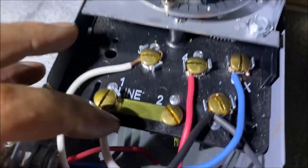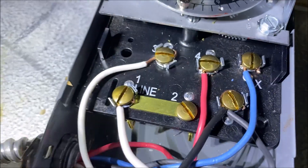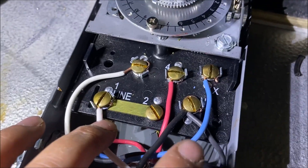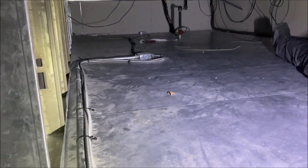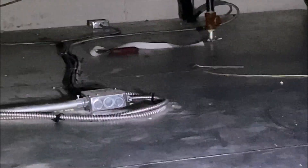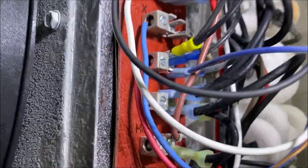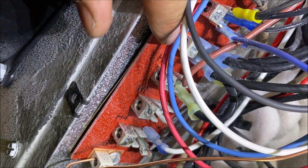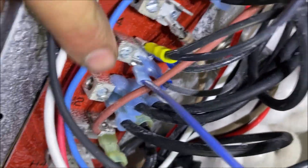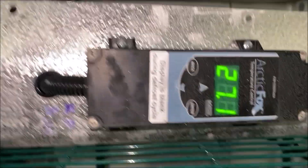I've run all four of my wires plus the additional two incoming — so terminals 3, 4, X, and N as we discussed earlier. I ran my four-wire conduit all the way down to the other end, going back into my liquid tight and into our evaporator coil. As you can see, terminals 3, X, and 4 all have power now, so we can power up our defrost cycle. Of course hook up your ground wire — and here's a look at that wire coming through the liquid tight.